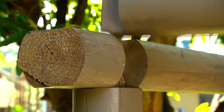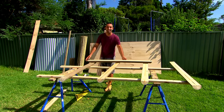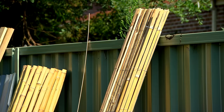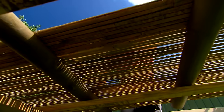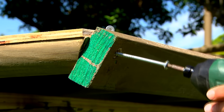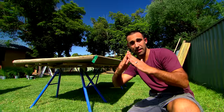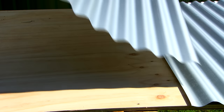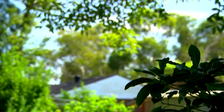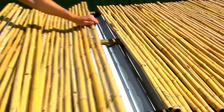To support our roof we need beams and a couple of posts at either end. For the roof, I'm starting from the underside and working my way up. I've got my rafters cut with a 30 degree angle on each end, then with this bamboo screening I'll lay that on top. Once that's in place I can put my plywood on and fix everything off — that way when you walk inside the cubby and look up, everything's complete. Because I'm making the roof in two parts, I'm attaching a ridge board so when the two halves come together it gives me something to attach them to. Now the underside's done, we can get onto the top. I'm laying out some corrugated tin which will make everything waterproof, then laying battens across that and fixing through the lot. Once that's down, some more bamboo — roll that across the battens, fix them off and we've got one half of the completed roof.